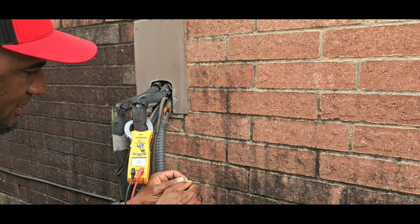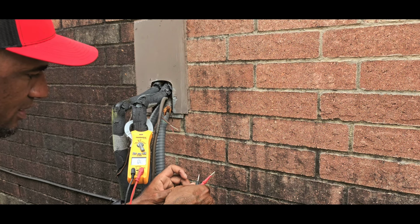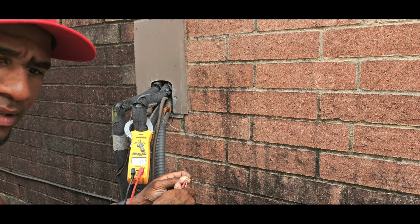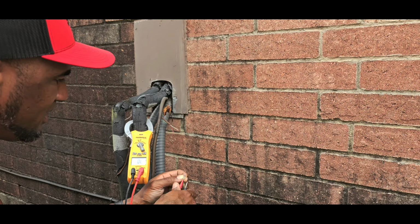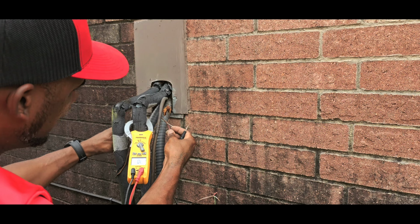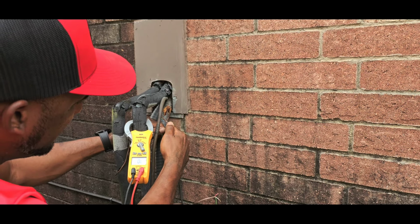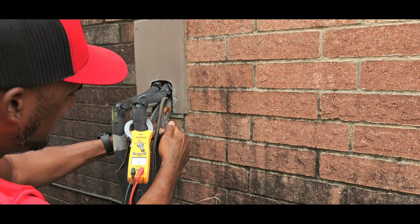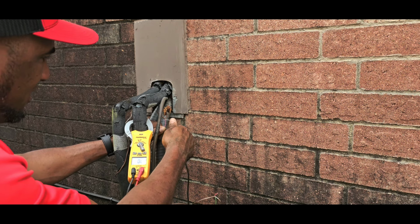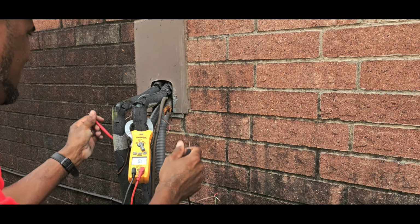See that? See it beeping right here. All right. Hear that beep? That means it's touching somewhere. If I go right here, I'm getting the OL. I go back to Ohms over here. See, I'm getting a 1.1. That's low, but I'm gonna take a chance